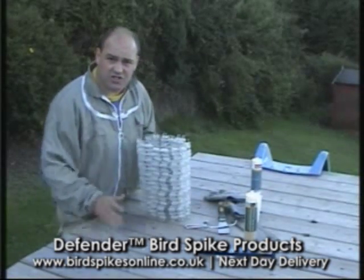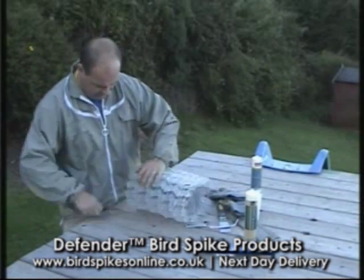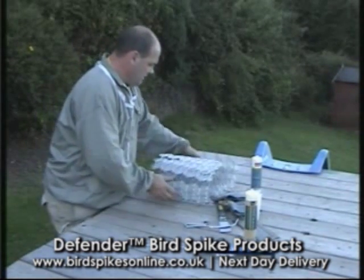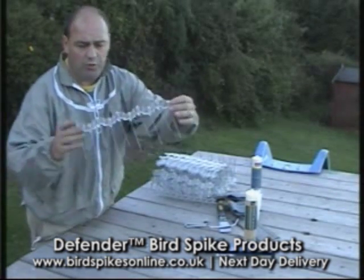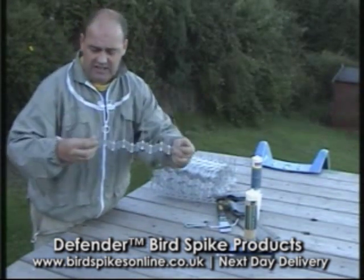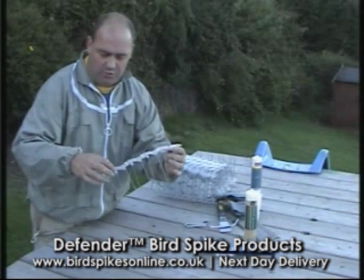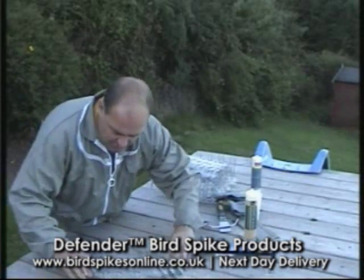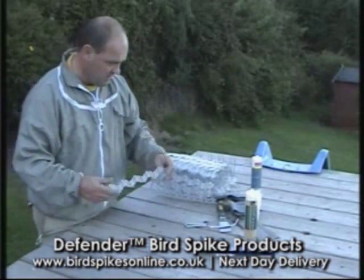First things first, we'll just have a look at the stuff that you're going to need. We've got a roll of pigeon spikes here. Key features there: as you can probably see along the bottom, we've got little star-shaped fixing holes. We're going to put a strip of glue along the bottom, and then when you press that down on the ledge, the glue will ooze up through the little holes.